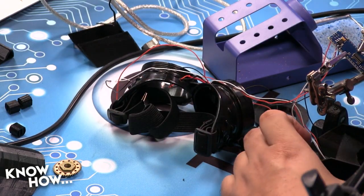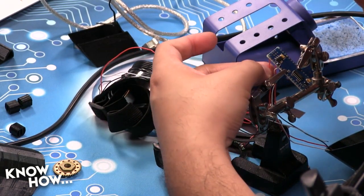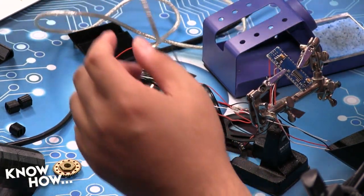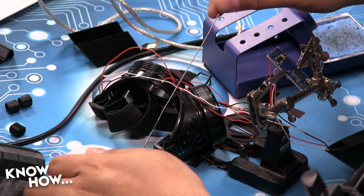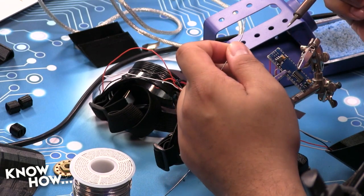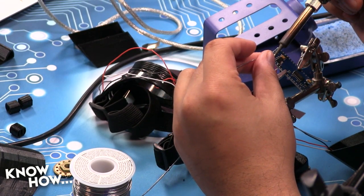All right. No problem. So what I'm doing on my side is, let's get this back into frame, like so. I'm wiring up the 5 volts from the LED to my Arduino. Because remember, ultimately, I'm going to pass power from the left side to ring two, ring one, and then to the Arduino. And this is the wire. There we go.